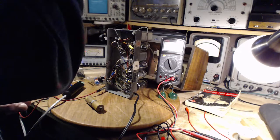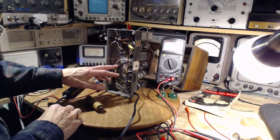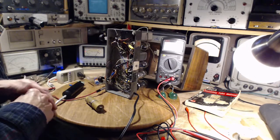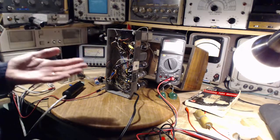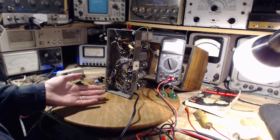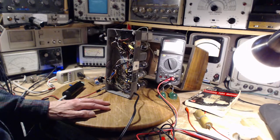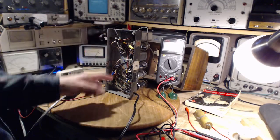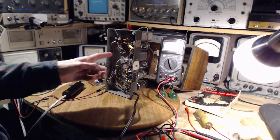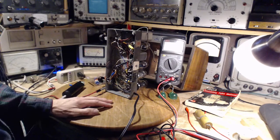But more than that, putting in the shielded wire here is kind of a last-ditch effort. That's all I had in my head. It doesn't make sense to have to redesign the radio. It should be sufficient the way it was originally designed, so you wouldn't expect it, but to help out. Some of these radios are so cheap, I'm not saying this one was, that in fact they were built with hums in them that would be covered up by the program material.